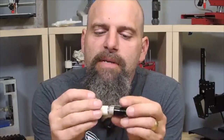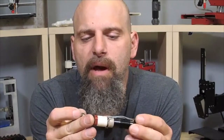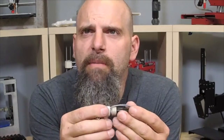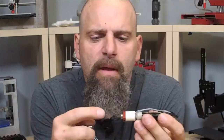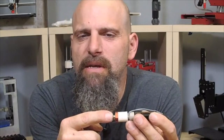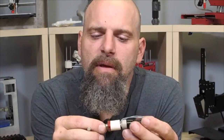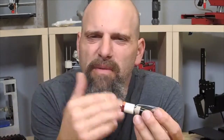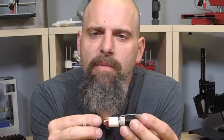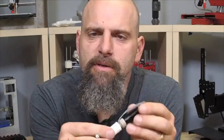So we're doing this high flow. It kind of came about because I was doing the old Big E, the prosthetic bot. I wanted to go faster with both NinjaFlex and regular material, and you top out with a 1 millimeter nozzle. I was topping out with the Big E. It was about a 1 millimeter nozzle, and we were going 80 millimeters a second. That's a lot of volume because it's a big tip. I wanted to go to 100, so it just wasn't doing it. And sometimes it would fail at like 60, but again, with a 1 millimeter nozzle. So I thought, we got to have something bigger, and the prosthetic bot will benefit from this. NinjaFlex will benefit from this. You can just go a lot faster.